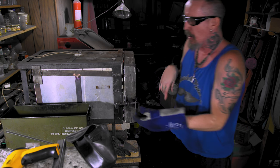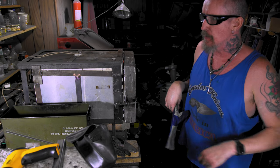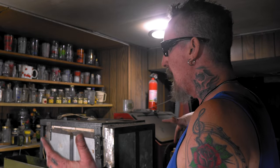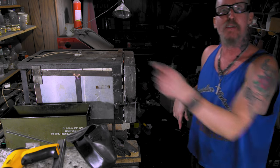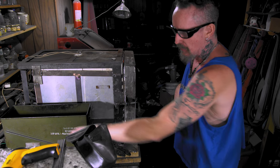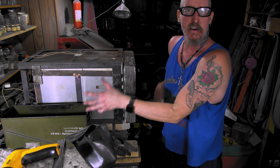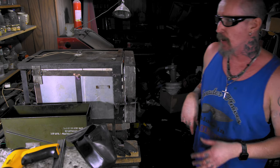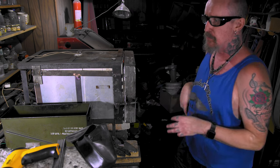All right. Went down to 1460. We gotta climb up to 1500 for 10 minutes. I think it's 10, 15 minutes. Yeah, the oven's pretty hot. I got the stove on here. There's a stove under my bucket that's got double burners, like a camping stove. I max it out and it gets it up to about 200 degrees. That way when you pull out of here and into here, you're not shocking the steel and cracking it and all that good stuff. All right, we're already back up to 1475.